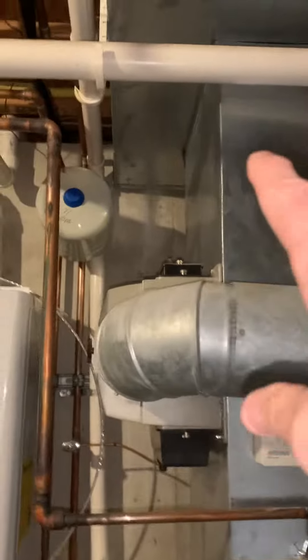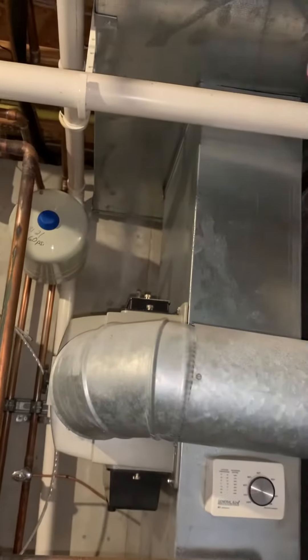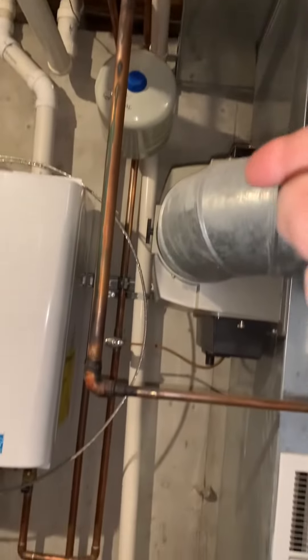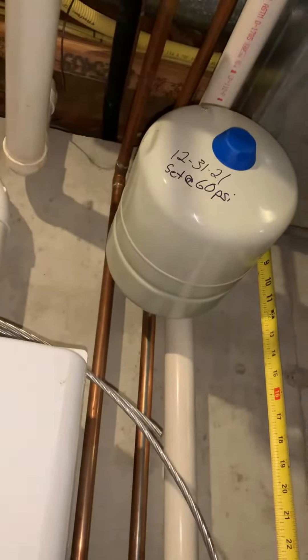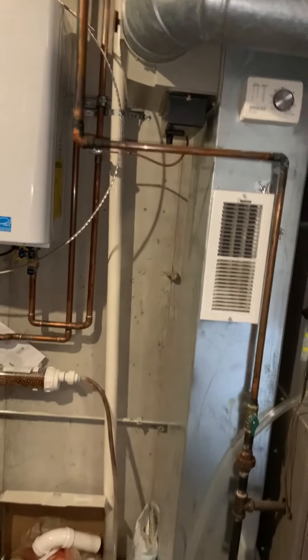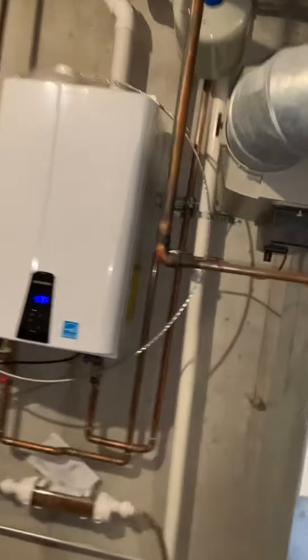If we look at putting in a new system, obviously base, furnace, coil, supply plenum — we'll have to look at scooting the return over a little bit and then offsetting over a couple inches, just to get clear of this guy here. So this is down about a foot before we can even create our offset. We've got to keep that in mind — a short piece, offsetting, and we only want to jog over about two inches so we don't get in the way of this valve or the actual tankless.